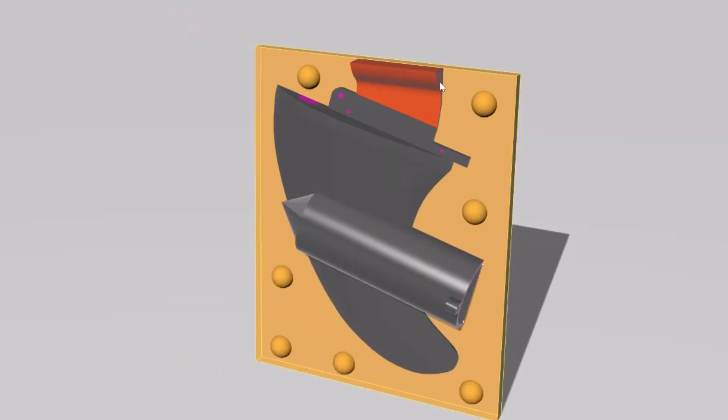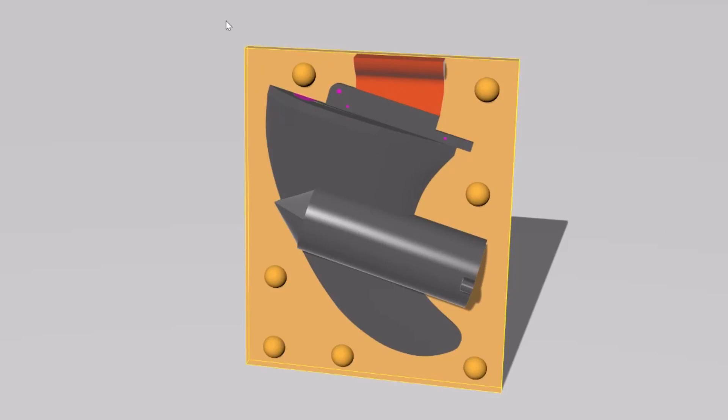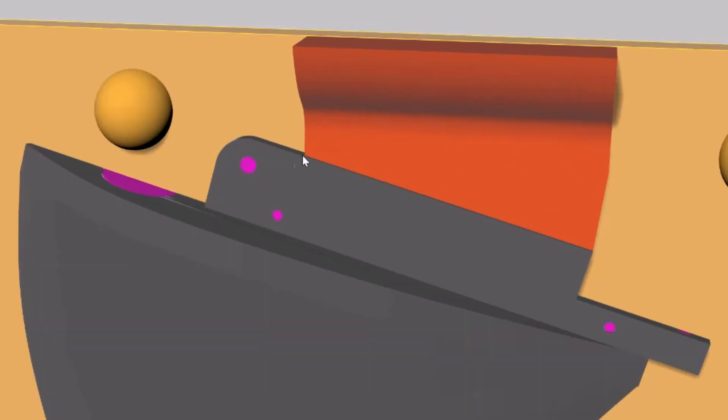The resin's going to clog the little sprue — that's the first place it clogs up, so you're done. You have to pour in a continuous pour; you have to have enough time to fill the part. I designed this sprue to fit the part. After the part is done, this whole thing will be a unit. Right across this line we're going to trim it, and at the same time we machine out all these holes and cut the threads in there, because this is a threaded part inside that area. We'll also trim the sprue off.